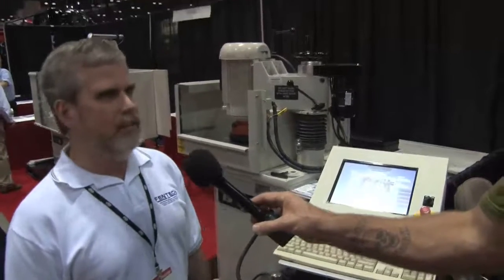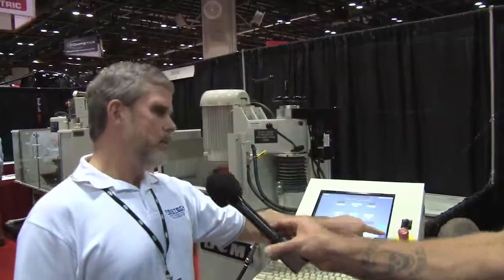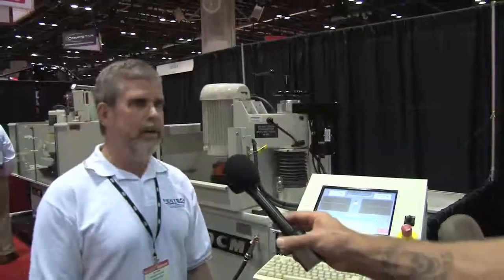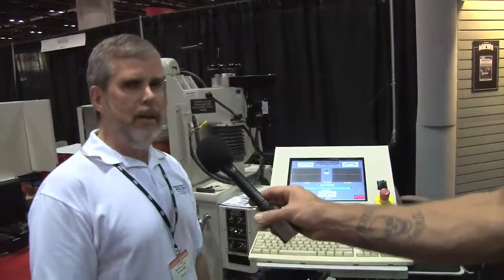It's very, very easy to balance. Once we have the setup information in and our bob weights installed, we've got a jog button right here that we can jog to watch the crankshaft and check our alignment. We then just press the start button and our crank starts spinning. The RPM is all controlled automatically — that's a unique feature of this machine. It goes to 500 RPM, and once the imbalance is down below that threshold, it kicks into what we call high gear and goes up to 750 RPM, because at this RPM you get a much better balance result and quality of balance.